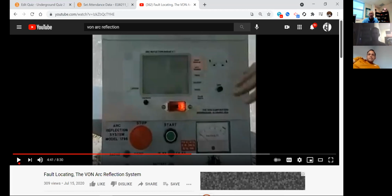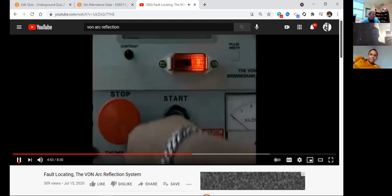This thing reads 250 feet of cable, but I'm showing an open point at 125. Uh-oh, guess what's halfway down the cable? A fault, okay? It'll give you a general radar reading of how far it is to the fault. Once again, I have not introduced voltage onto it yet. That's such a general location. Pretty nifty tool.